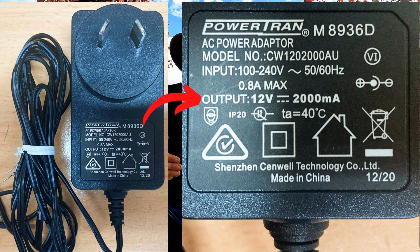Now we need to figure out how much power you're going to use. Every device should tell you how much current it will draw — it might say five amps, for example. That means it will draw five amps per hour every hour that it's on. With that you can calculate your battery capacity. We've got 210 amp hours — rounding down to 200 for simple maths — if I was using something drawing five amps per hour, that's 40 hours of runtime. So we could operate that five amp device for 40 hours without charging those batteries.